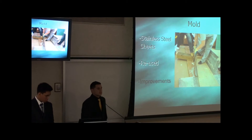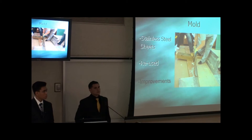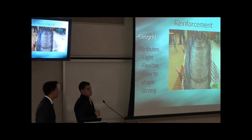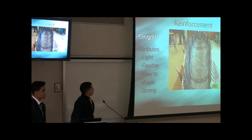A weakness of last year's canoe was its weight. After trial and error, we were able to come up with a mix that was lighter than last year's — a mix that allowed us to easily maneuver the canoe on the water, and was also strong enough to withstand the rigors of the competition. After deciding what we were going to do about our mold, we then looked at our reinforcement. As John said, as a group we all decided to use GeoGrid, because it is light, flexible, easy to shape, and very strong.